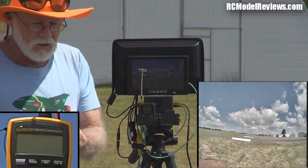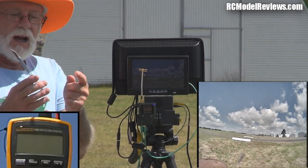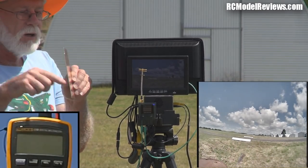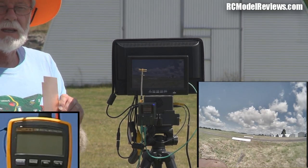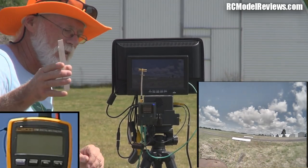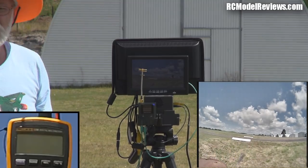To remind you what's happening here: we have a right-hand circularly polarized wave coming along hitting the antenna producing a signal. I have a piece of copper strip which bounces the signal back, meaning the reversed signal comes out — left-hand polarized. If it's a poor performing antenna from the perspective of rejecting reverse polarized signals, you would get a lot of change in the picture intensity, but nothing. The RSSI isn't changing much either. I am impressed — the Pagoda is working just as I thought.